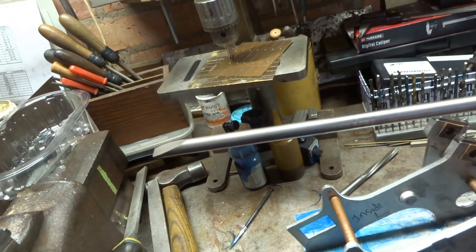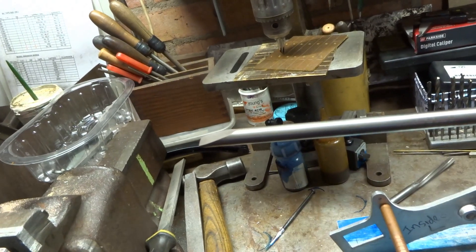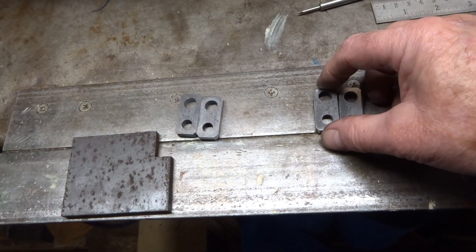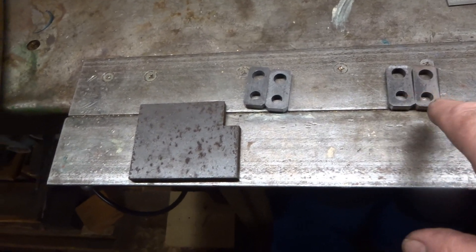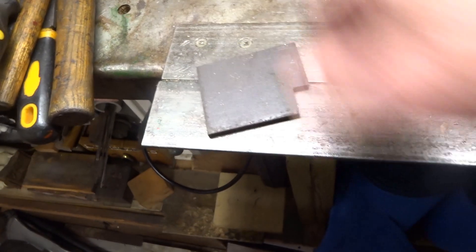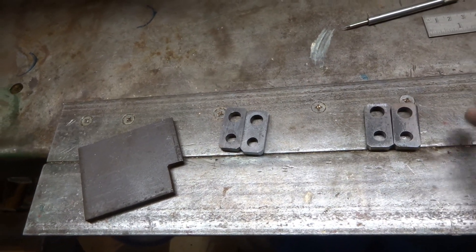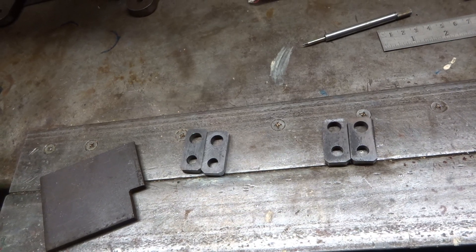This rod will now pass through the entire set of bearing supports on this engine and make sure we're of the right diameter. The side webs for the two crankshafts on the drawing are called to be made from stock 5/8ths wide and 3/16ths thick. Well, I ain't got none, so I've cut some bits of plate from this very rough quarter-inch plate steel, cleaned them up a little bit — not perfect as yet — and carefully put the holes through, so that hopefully when I put it all together everything on the crankshafts, crank pins, et cetera, will all be in line.